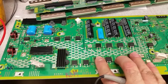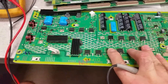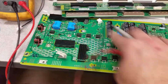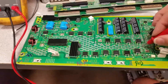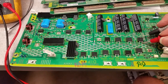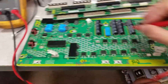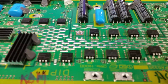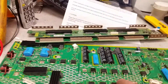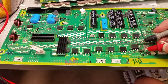This is one transistor — it's a complex transistor made out of three in parallel in order to increase the current and the power they can dissipate. Same here and here — those are actually three switches, and they have diodes, discharging diodes, in parallel. This is the gate, those are the switching elements, and this is a good set. When those are good, usually these are good as well because they tend to fail together. The transistors here are this one, this one, and that one — those three — and those three are the discharging diodes for them.